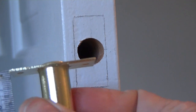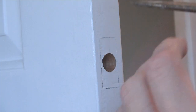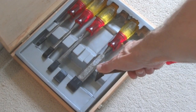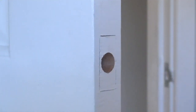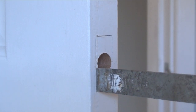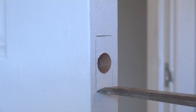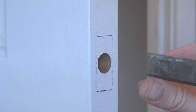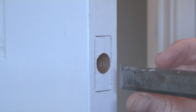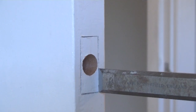We've got to remove approximately 2mm from the front. I've got my 19mm wide wood chisel and I'm now going to very gently tap around on the marks just made on the door. If you've got a wider wood chisel you can use that, or don't worry if you've only got one chisel — you can just very gradually work around. The key thing with chiselling, particularly if you haven't done it much before, is patience. If you rush it you will do a bad job, but if you're careful and precise, chances are you'll end up with a really lovely clean finish.